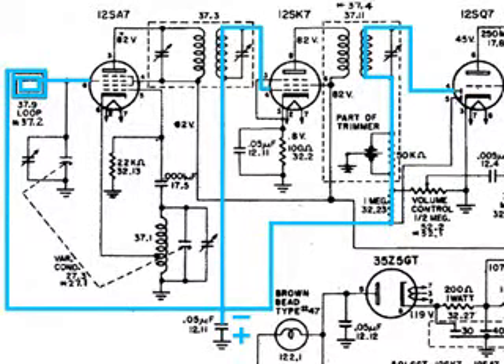This drawing shows the real working part of the automatic volume control, which is pretty much identical in most AA5 radios. Starting at pin four, that plate can only conduct when it's positive. So if the top of that coil is positive, then the bottom of the coil is negative. This negative voltage is fed through a couple of resistors over to the volume control, and eventually makes its way down through that 1M ohm resistor and down to the .05 microfarad capacitor.